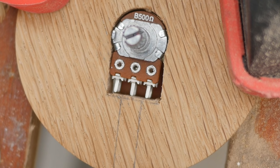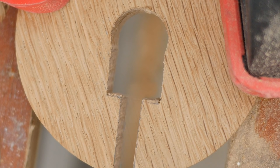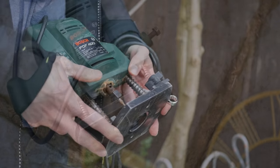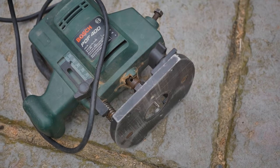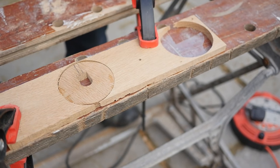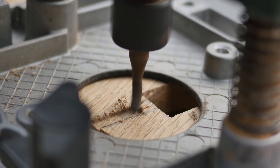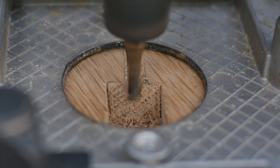All we've got to do now is cut a groove for the wires to be threaded through later. The easiest way to do this is to use the coping saw to cut completely through. However, as my oak platform is thick enough, I thought I'd take the opportunity to try using a router, which is a tool I've actually not used that much. This is just a cheap one I'm borrowing, so it should represent what you guys can also do at home. After securing my base in place using the wood it was cut from and some double sided tape, the first step was to adjust the height of the bit so it protruded about a millimetre. I then carefully slid the bit between my marks, with the router faithfully carving it out for me. The bit was then lowered another millimetre and the cut deepened a little more. This was repeated until it was 6 millimetres deep.